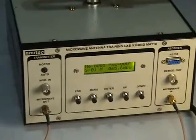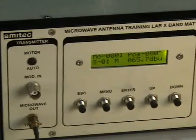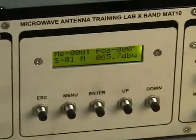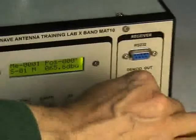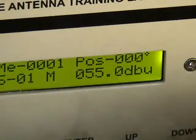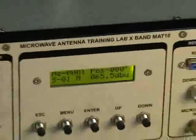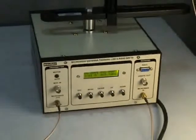Right now both antennas are horizontally polarized and the received signal strength is 66 dB microvolts. If the receiver antenna is removed, the noise floor is around 25 to 30 dB microvolts, which is approximately minus 70 dBm. This minus 70 dBm noise floor is achievable only with the help of superheterodyne receivers and is very difficult to achieve using power meters or other conventional instruments.